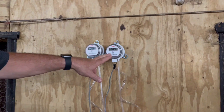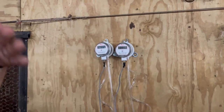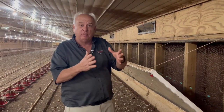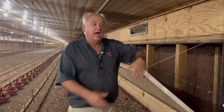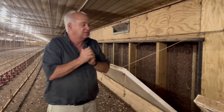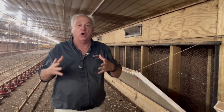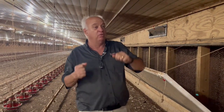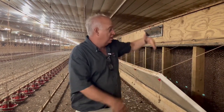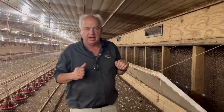The pressure required to pull it through the pad and the small tunnel opening is about 0.08. So it takes about six to seven points of pressure to pull it through the pads, and another two points of pressure to pull it through this relatively small tunnel opening, giving us a total of about 0.08. So for the fans to pull the air from outside, through the pad and through the 38-inch tunnel opening, is about 0.08 to 0.09.